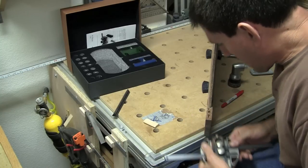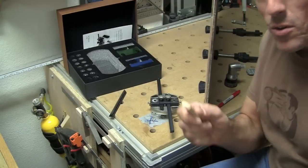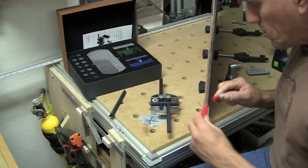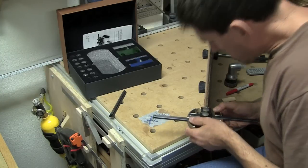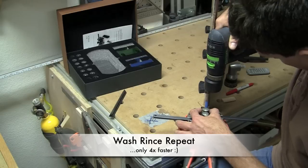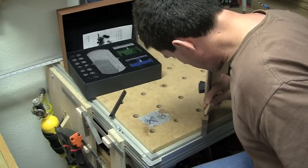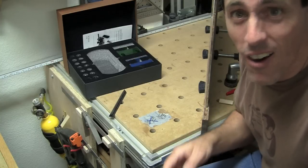There's some chunky crusty stuff in there — I swear it's hardboard that they filled it with. So we got the one hole made. Now I'm going to take the 50mm domino, put it here, and mark how much further I need to go. I'm just going to look down through the hole for lining up the second hole — once I have the second one set, we're golden. Right to the edge. Dead on. All I would need to do now is pare this little piece off, but I could actually just put the drilling jig in the middle and hog off most of it.